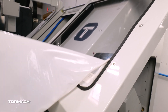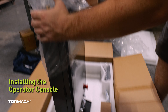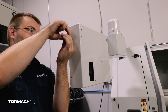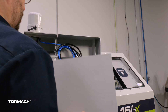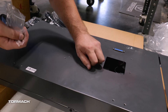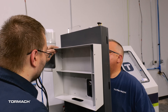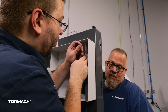Remove the window protection. To install the operator console, remove it out of the packaging. Then remove the rear panel on the op console support arm using a hex wrench. Set the screws and panel aside as they will be reused. Snip off the zip ties of the cable within. Find the support screws and make sure that they fit. Have a co-worker hold the operator console up and work together to align the holes. Install and thread in all eight screws to secure the op console to the arm.